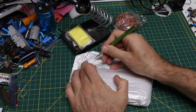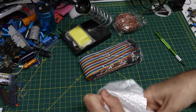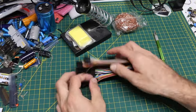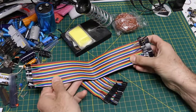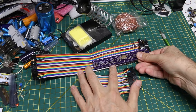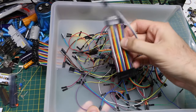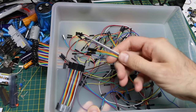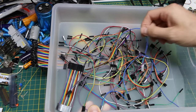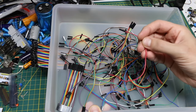This one I do know the contents — it's DuPont jumpers, because again, running out of those. I got some different lengths; I don't even know if I've ever had them this long, but I got some of the short ones and the longer ones, female to female. So that's a foot long. I'm kind of running out of the female to female. I've got a couple that have never been peeled off, so those are most likely never used. I've got others where there's a couple still bound together, so I probably used these a couple of times and they may still be intact. But as these get ripped down to the individuals, I've probably used these many times and they just don't hold contact anymore and I get intermittent issues.